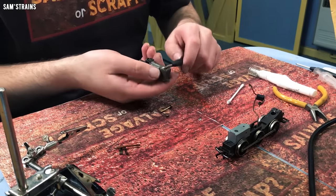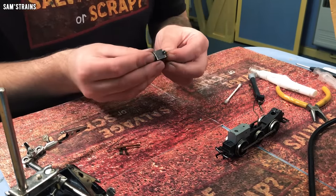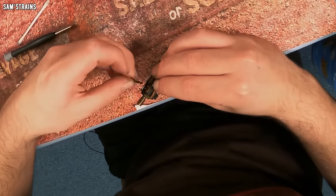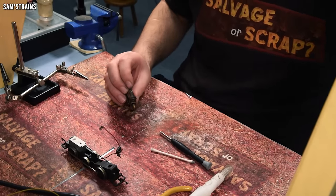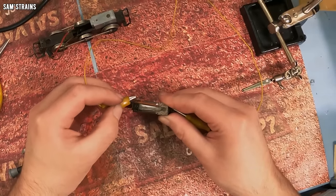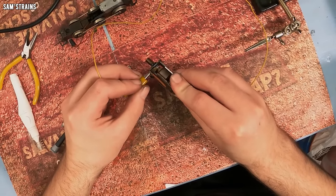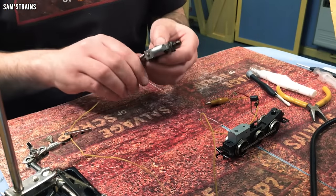Is that better? It should be better. Oh yeah, look at that — that is what you call a strong magnet now. Awesome. Reassemble. Still don't know if this motor works yet, and that is worrying when there's about a quarter of an hour left. Brush number one into position and brush number two into position. Let's get some power to this motor and find out for the first time whether it's actually going to work. No sign of life — it did work and then it stopped. But with a little coaxing, the motor slowly came back to life. It doesn't seem the happiest motor in the world, but it does seem to be working, so I think we'll persevere with it.